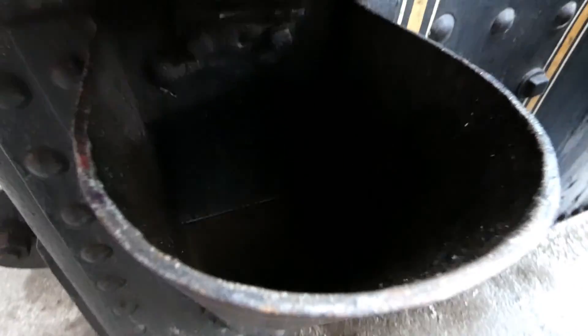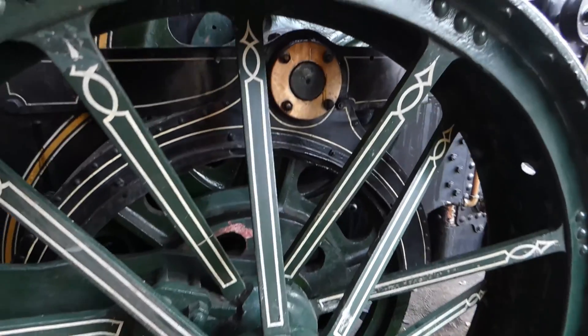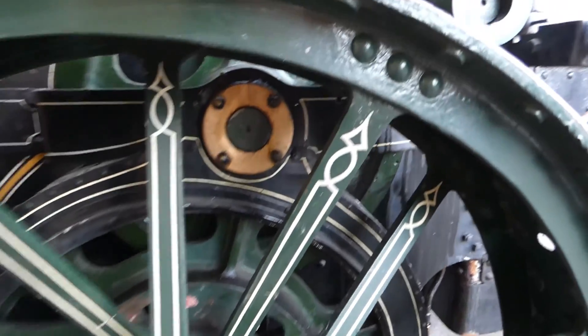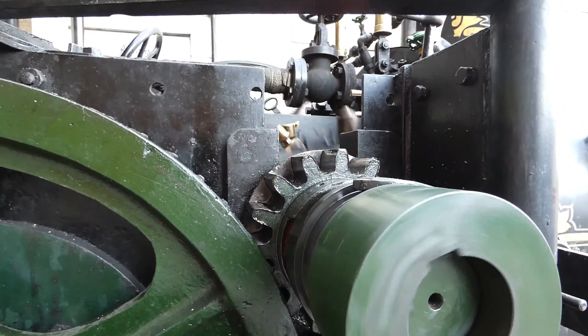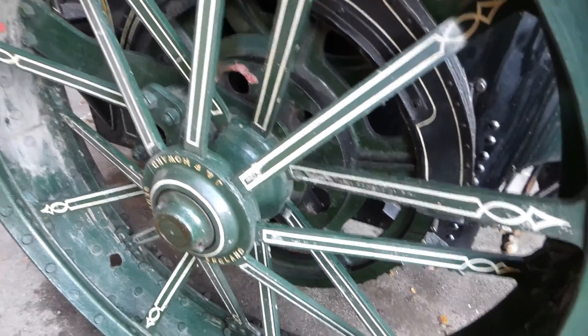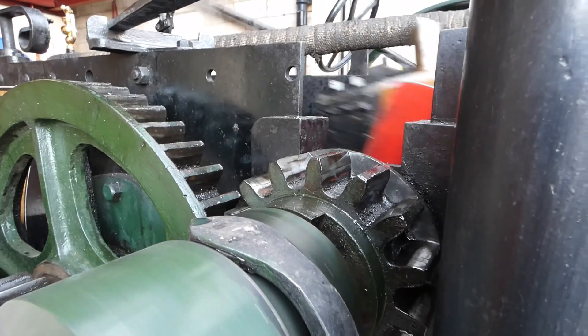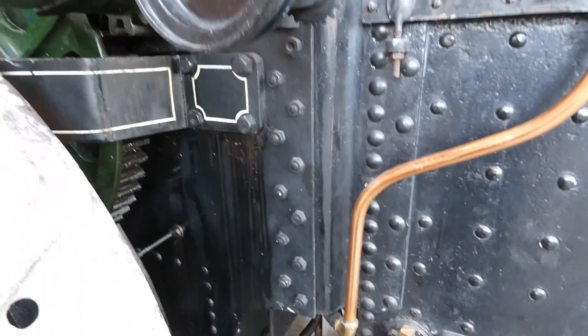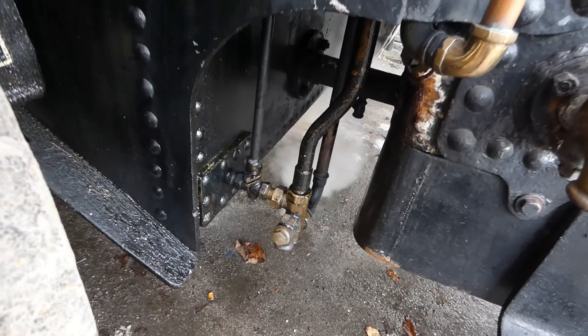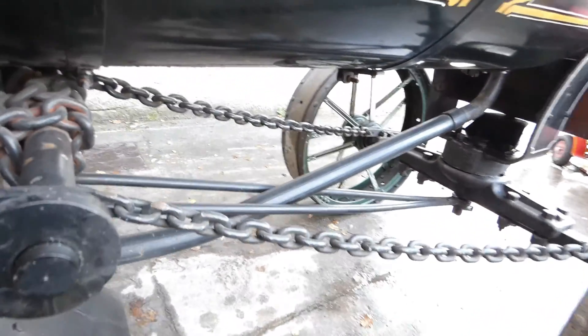Using steam, it will lift water out of the river or water trough. That's the water filler at the bottom. Those are the main road gears, which are in very good condition for being a 151-year-old engine. The main road gear there, and a view of the dog clutch which engages the gears. There is the injector at the bottom. The dog clutch engages the gears when moving on the road. The injector uses steam pushing through cones to inject water at high pressure into the boiler, overcoming the boiler pressure.